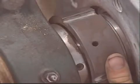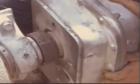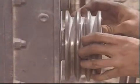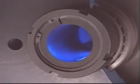With the bushing nut providing thread seal protection, Falk's TA taper inboard design permits close mounting to reduce head shaft loads and allows closer belt positioning to extend high-speed bearing life. Important operational benefits that other bushing types cannot match.